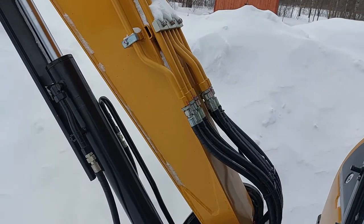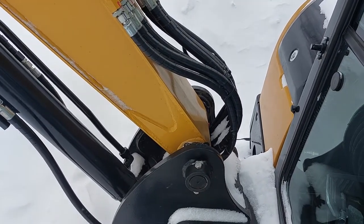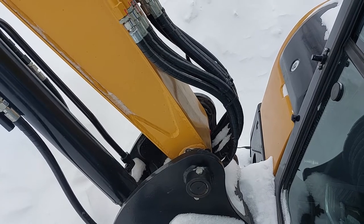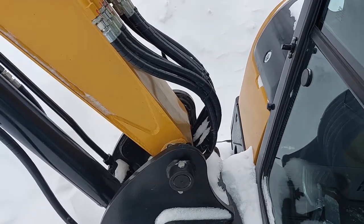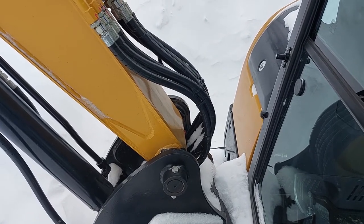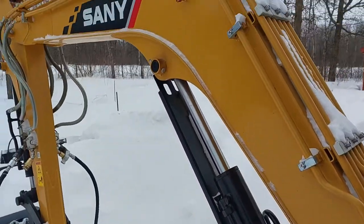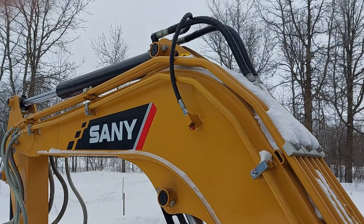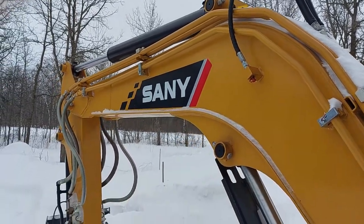As far as I can tell, it's a really well-built machine. You've got reinforcements at the bottom of the boom there — fish plating or whatever you want to call it. The king post, or swivel, is very well-built. It's got replaceable pins and bushings, everything can be greased. There's even remote greasing here because the grease nipple is positioned over there, which is fine by me.